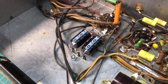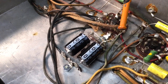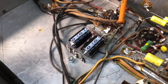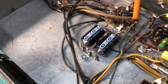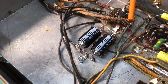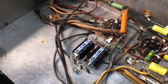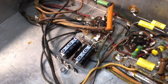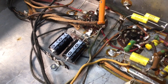I've got the electrolytic capacitors mounted and it turned out really neat and very, very easy - just used a couple of terminal strips as you can see. One of the negative sides goes to the chassis ground and the other loops back around to the center tap of the power transformer, and of course the other goes right back to the rectifier tube.